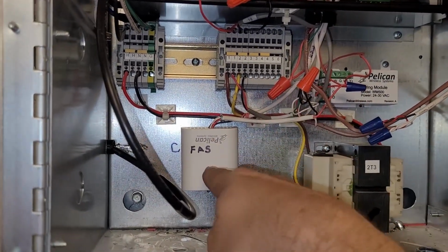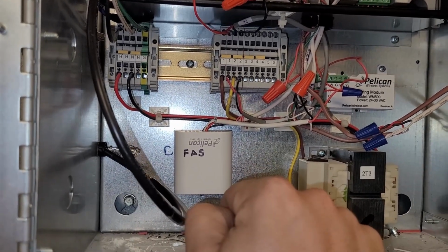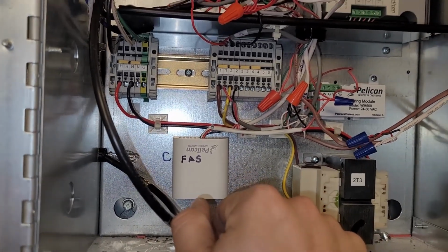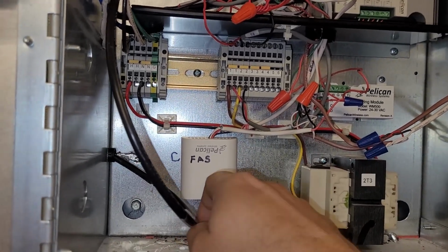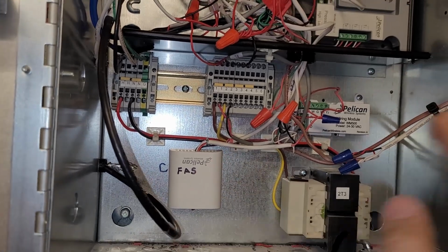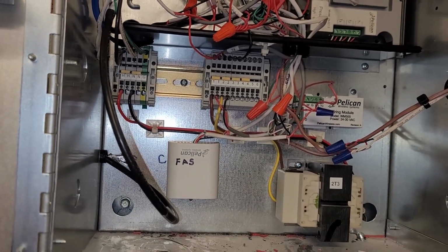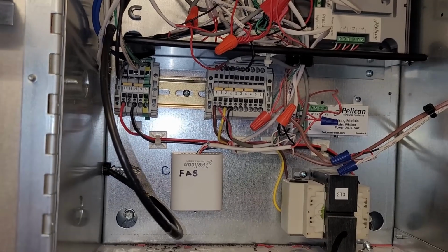You can also put a TA1 underneath it and pull in either a temperature or an alarm. I think in this case, underneath a PM5, it's mostly just for alarm status. So to get the fire alarm on the Pelican system, we used a TA1 underneath a PM5. You can also put a TA1 underneath a thermostat. So that's another way to do it.